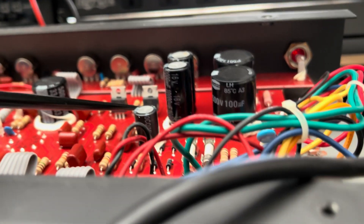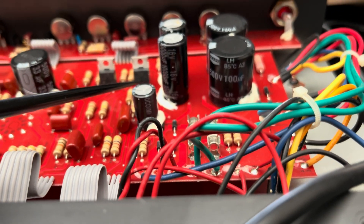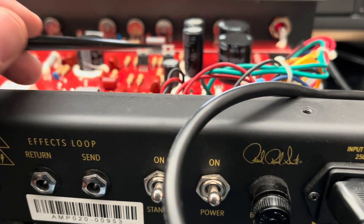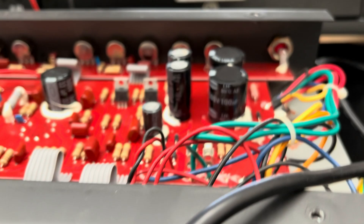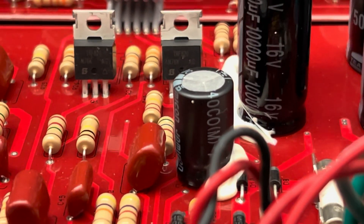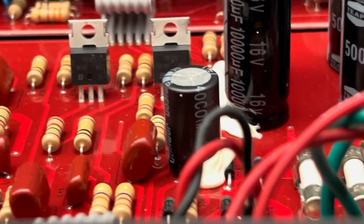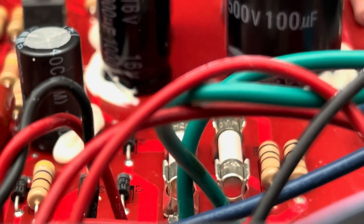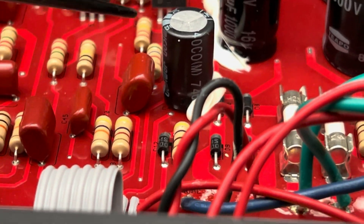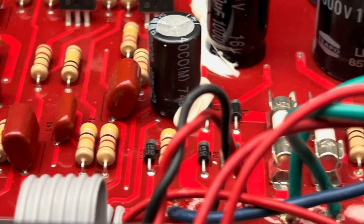Let's see what's up with these regulators. I need to zoom in and check these numbers — I can't really see them from here. I want to see if they're a plus-and-minus supply and if they're the issue, or whether we have a failed supply capacitor.